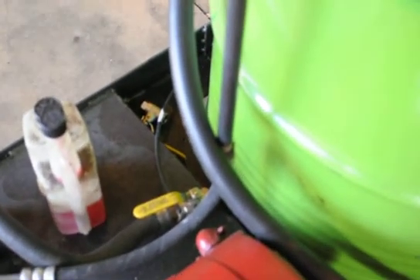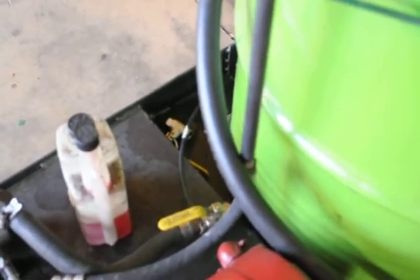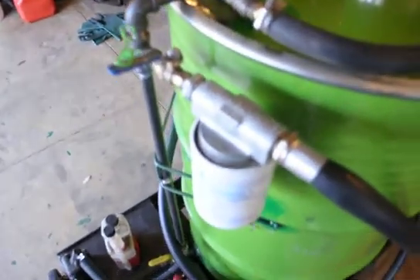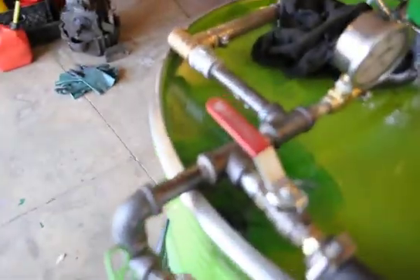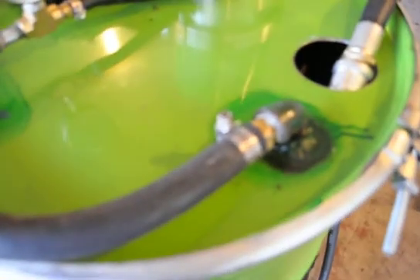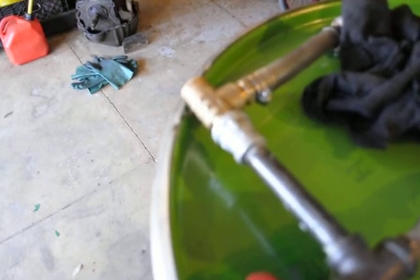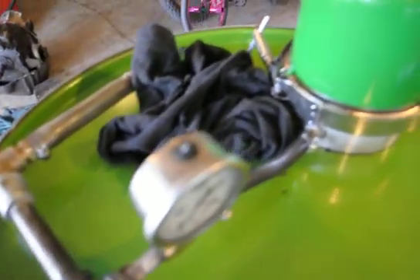I had them adapt a line for me down at Napa that will go to black pipe. They told me this will only hold about 500 psi, but I think a power steering pump maybe goes to 150 psi. It goes to this black pipe and I've got a few valves up here — I can kick them off and run fluid through the filter and out the tube to dump it into the truck, or close that off. This is a bypass so I can bypass pressure from the main line, and this is a pressure relief valve that comes on at about 100-102 psi, just in case something happens to the centrifuge.